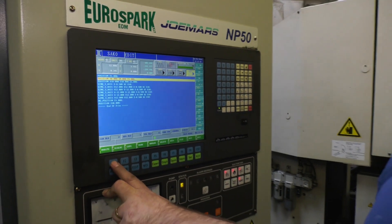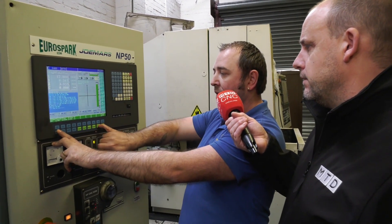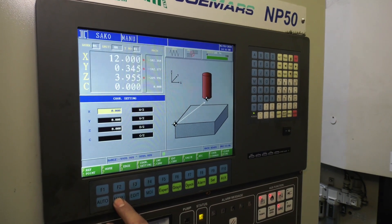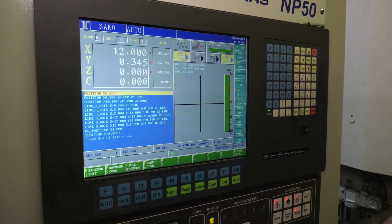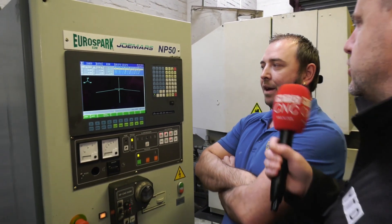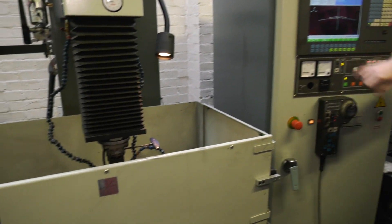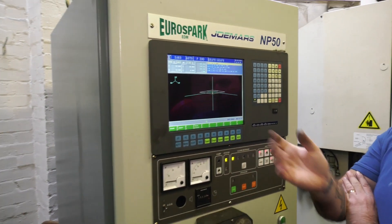So essentially you're just moving 12mm on either side? Yeah, nice and simple. Once we've done that, what's next? The next job is to dry run the program, just to make sure nothing's going to crash into anything as we go along. Set that on zero, set your auto, and press go, and go onto a graph screen so it'll actually show you what it's profiling onto the job. So this is a simulation of what we're actually going to be doing in the machine? Yeah, so you know nothing's going to go wrong at all with your program, and you're not going to crash into anything or bend any electrodes. So you can see your incremental movement as it's cutting around the square, and then it'll go back into the centre and feed up through the Z, so you know exactly what shape you're cutting into it.